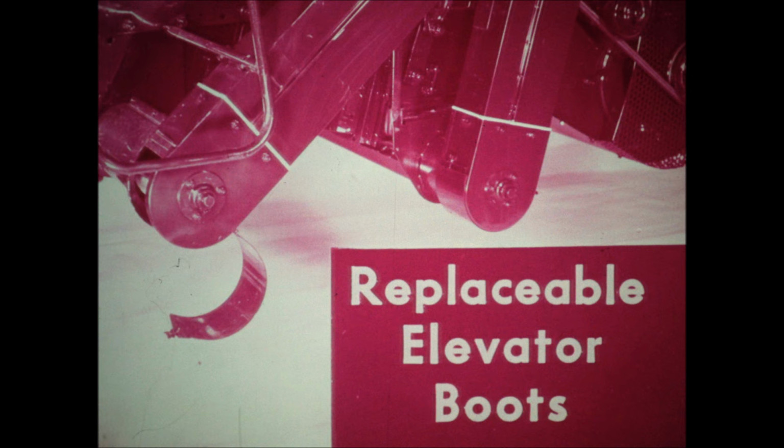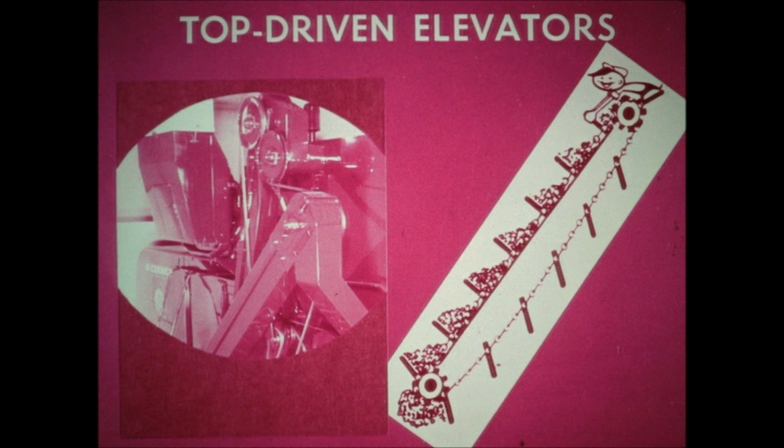Here's a profit plus. Both the 151 and the 181 have replaceable heavy gauge boots at the lower ends of the elevators. You simply replace the boots, not the entire elevator. Note the handy clean-out doors. Speaking of profit and time saving, why lose precious time with old-fashioned low-capacity elevators? IH Harvester threshers have top-driven elevators with gentle rubberized flights, which lift the grain load rather than trying to push it. Result, faster operation in heavy yields.